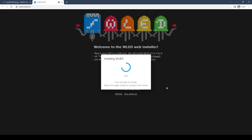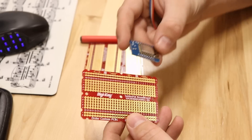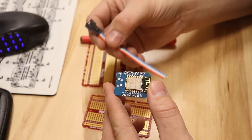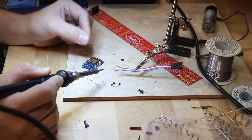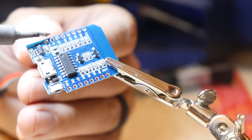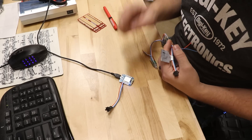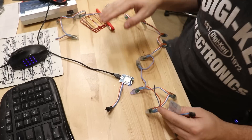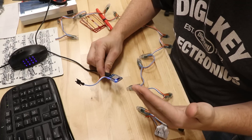Now that I've got the WLED firmware flashed onto this microcontroller, it's time to solder a connector onto the board that will let me connect it to the LED string. My project is so simple it literally requires three wires — just 5 volts, ground, and a data signal — so I'm just going to solder this connector directly to the board. Once I've got a whole string of LEDs, I wouldn't want to run them directly off the power supply on this board because it doesn't have enough current — I would have to use an external power supply.